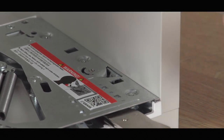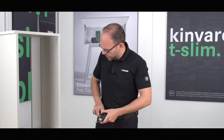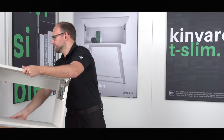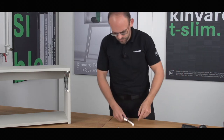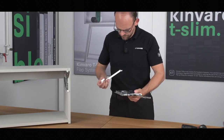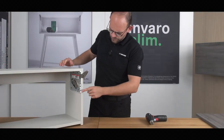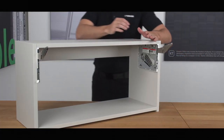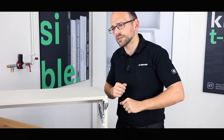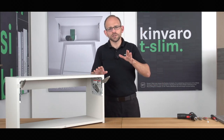The fourth screw is inserted diagonally into the top panel. That looks good. Now we do the same thing on the left side — we first break the small cover cap and the mounting bracket again. This is how it's fitted. Now we can break off the stops on the left and right towards the side. Now we have everything prepared and also fit the Tipmatic pin. The pin is mounted and the cabinet is fitted.